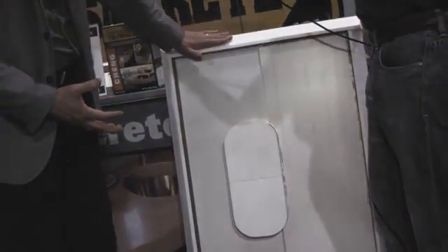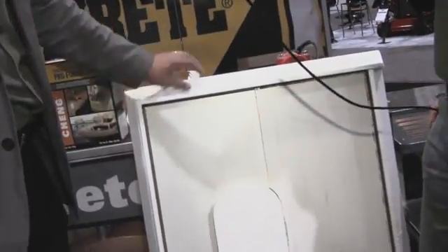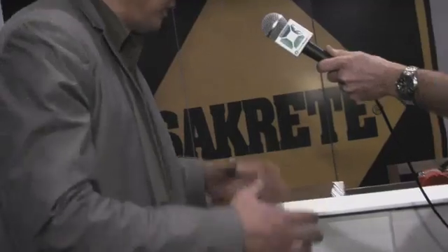We came up with this ProForm easy-to-do foam forming system so that you can make a countertop very, very quickly and easily, because time equals money. You can make a simple countertop — not the kind of elaborate stuff you might do for a real custom job — but if you're really wanting to put out countertops, this is the way to do it. This foam forming system uses double-stick tape to common melamine, and we have a foam knockout with a simple Mylar wrap around it. All of it is available through our website, along with this foam liner. You just stick it down to the shape you need and pour. Anything two and a half inches or less, you can use this system.